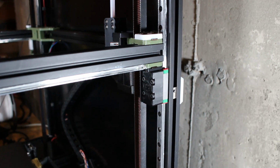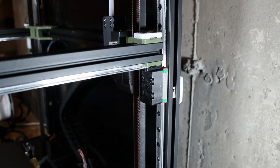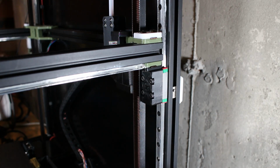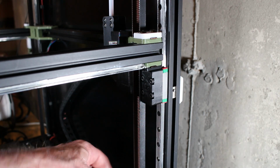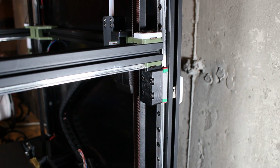As I understand it, both myself, possibly in the past, but then other people who have assembled this printer have actually left these bolts kind of loose in the past based on the old mounting system. And a lot of this was, again, to make sure and allow for the motion. However, since we have bearings here now, you should tighten these down all the way.